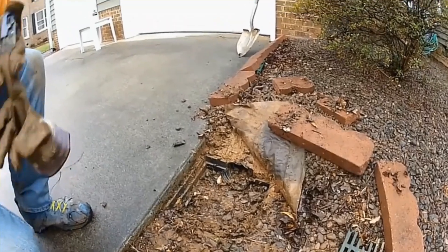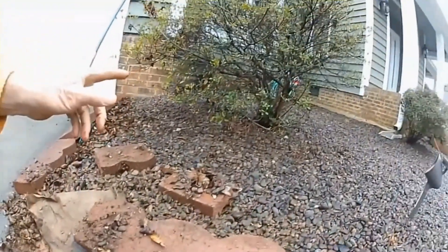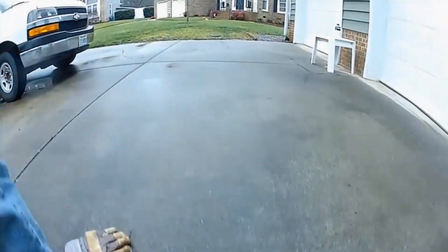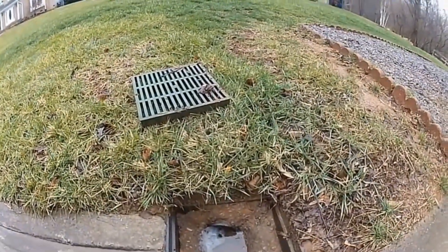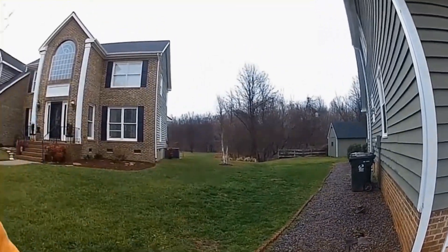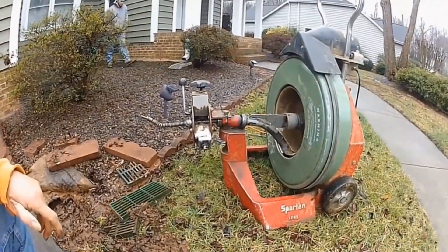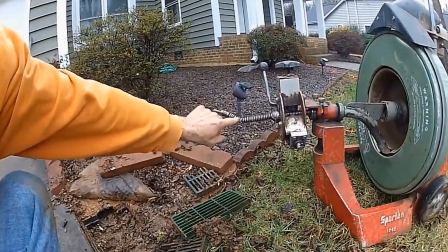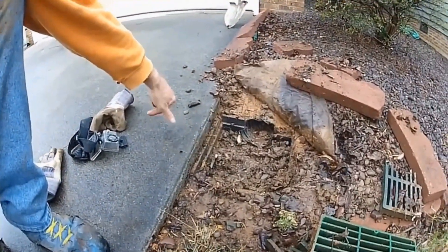You can see this kind of a makeshift catch basin here, and they've got a line that comes in from back in this graveled area, and then they've got a line that goes over here across the driveway and empties out into this catch basin, also full of dirt. It picks up that downspout and travels all the way out to that ravine back there. We're going to use our Spartan 1065 — this is a sewer cleaning machine with a steel wound, spring wound cable that has an inner core. As this machine turns, it's going to go through this pipe and clean this drain out.